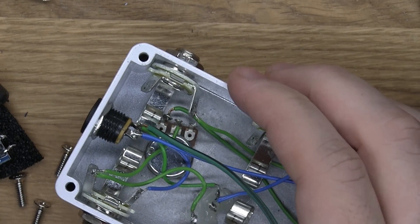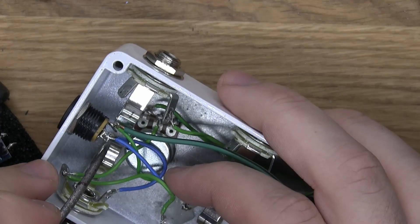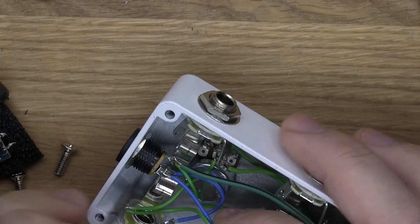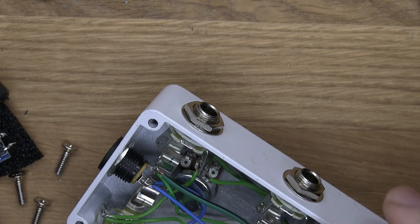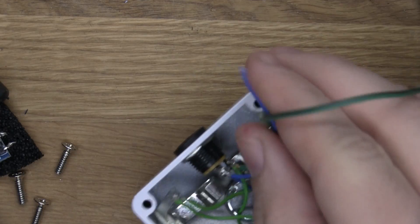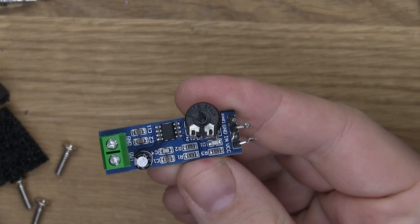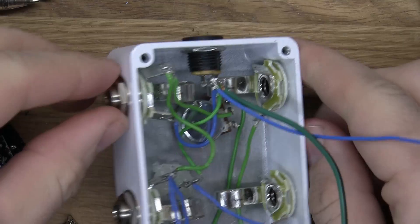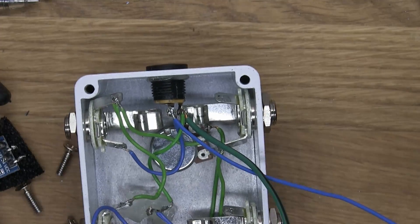Let me point with my awl. On this ground leg, I added another blue wire. It's the bigger leg. And on the last leg, ignoring the middle leg, I added another green wire, which is the lead. Now I have these two wires, and they are gonna get connected to the ground and the VCC here. And the next step now is gonna be to unscrew these two jacks. So I'll be back in a second when I've done that.